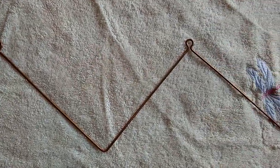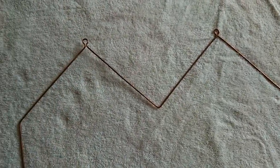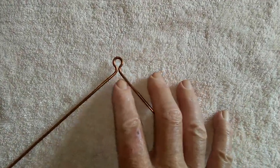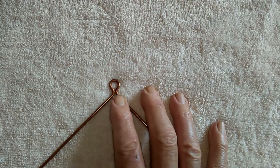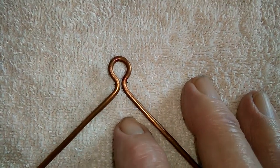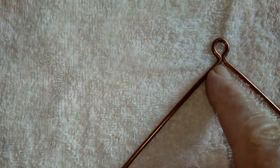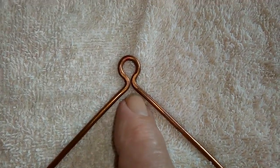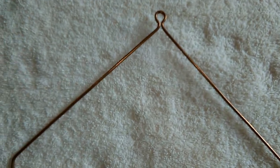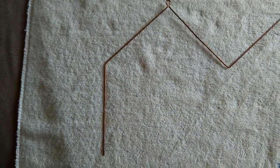Here's the hoverman element — this is one I made for my retail antennas. I set it on a nasty old towel here on the car, but you can see its shape. This is a retail part; I have that eyelet bend. It's not super difficult to make but it takes a little practice. For the most part there's a right angle here, there's a right angle here. If you saw the diagram on this page, you'll see there are all right angles — all the measurements are seven inches. You don't have a lot to think about with a hoverman element; it's all seven inches.